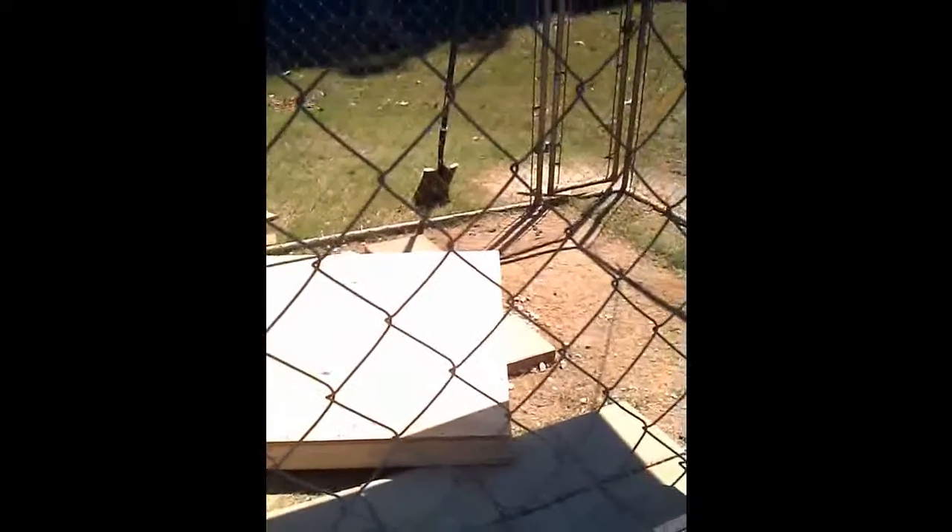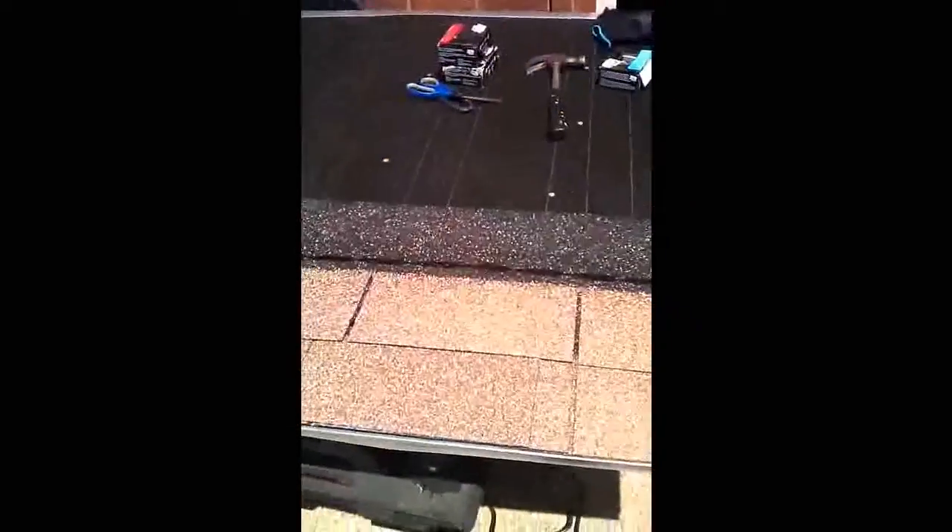Working on the roof right now. This is the back part of the roof right here. You want to go ahead and put your shingles starting at the base. What I did was cut up one shingle and just put it around the base right here so that this area is covered. Also because you've got these holes in the shingles where they separate, I felt you needed a base that those can fall down on so the water can't get underneath. All I did was cut one of these in half and put that around the base of the back of the roof.